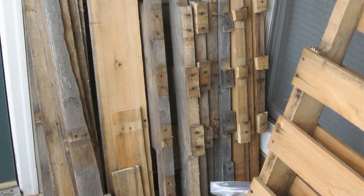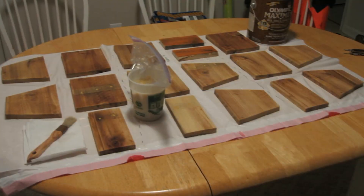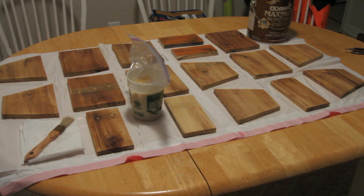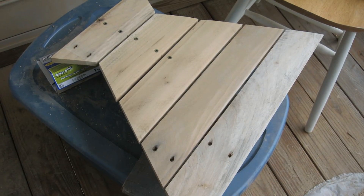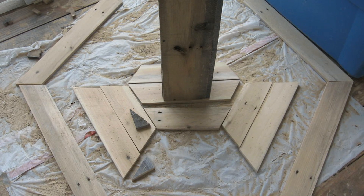To make the table, break down the pallets into individual parts. Cut the pieces to a hexagon-shaped pattern using the mitre box. Apply your desired stain to each piece of wood, then assemble the table using Polk's tutorial as a reference. The result is an awesome outdoor furniture setting that you made for yourself for almost no money. Check out Polk's profile to see more of his instructables.